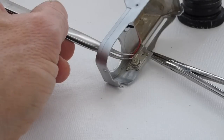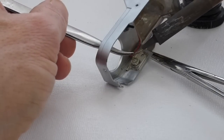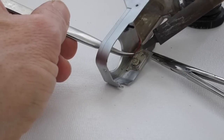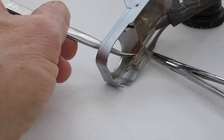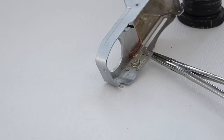Position the top cover as shown. With your left hand, take a pair of tweezers and access the wire through the opening of the ASA dial. Position the wire against the contact of the PC socket and solder quickly. Test the wire for proper connection.